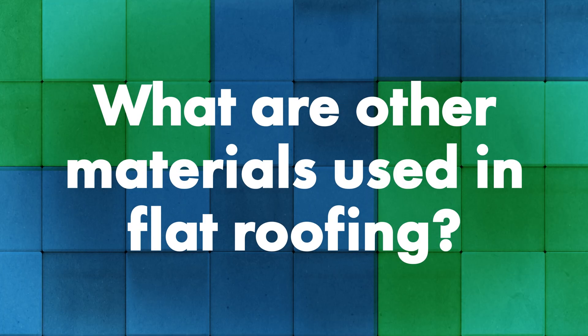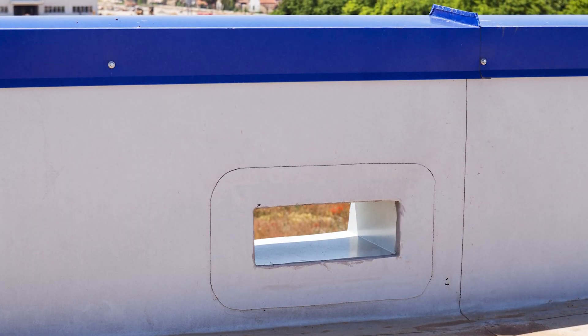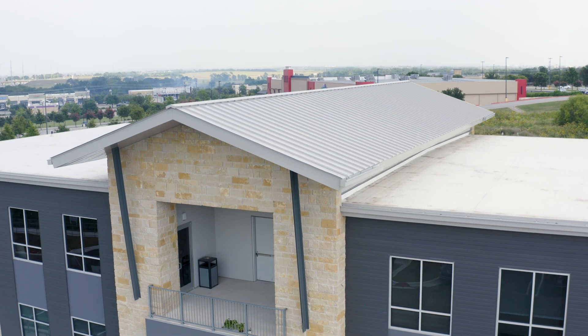The PVDF-coated metal is what's visible from the ground on a flat roof. Membrane-type systems — TPO, PVC, EPDM — also use what are called clad metals, where the membrane can be heat-welded directly to the clad metal. You can't intermix them; it must be a TPO clad metal with a TPO system, PVC clad metal with PVC, and so forth. The clad metal is what keeps the system truly weather-tight at the edges. The colored architectural metal you see from the ground also ensures the edge stays down and performs in uplift scenarios.